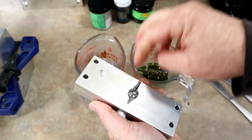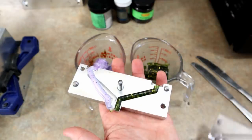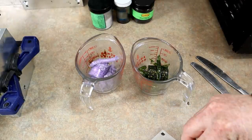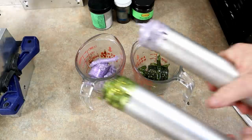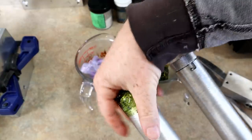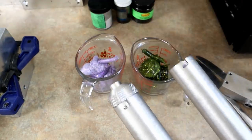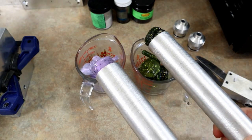Here's a look at the blending block and its contents — you want to reuse these. There are our two halves — every little bit helps. That might be the difference between that extra cavity filling or not. Same with your injector plugs — all of this is not waste. You want to try to get all of this stuff back into the cup and back into the molds.